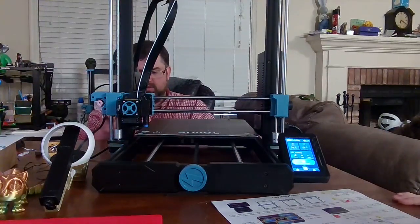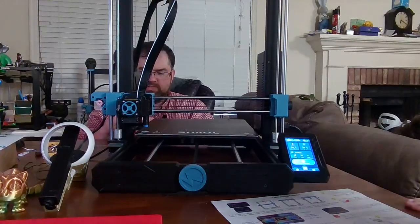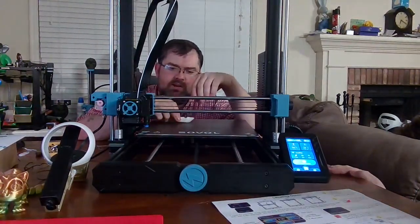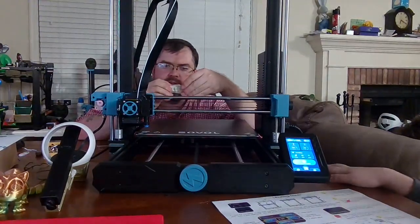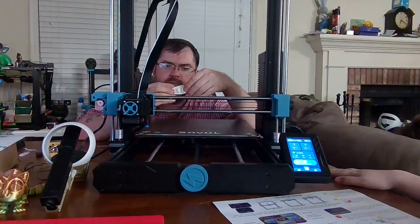Needed more brim. There was no brim. I guess it was printing too fast when it started doing this floor. At the front of the boat, I seen it knock it off the bed. You got to figure on this print, there's words on the bottom with voided space. So it wasn't a solid print all the way through on the bottom anyways.